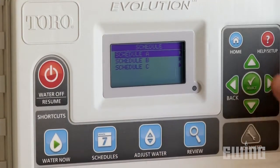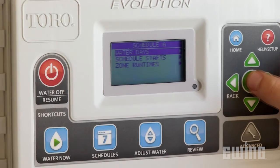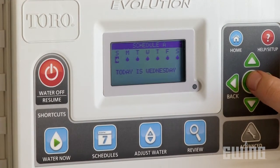To start, the manufacturer suggests that you program your irrigation controller to run through its cycles every day of the week. The idea behind this is that the S100 will prevent unneeded irrigation cycles based on the moisture content of the soil. Obviously, this is not possible if your location has water restrictions. If you do have restricted watering days and times, then you can skip this step.